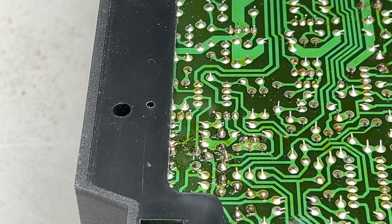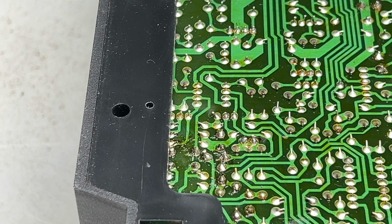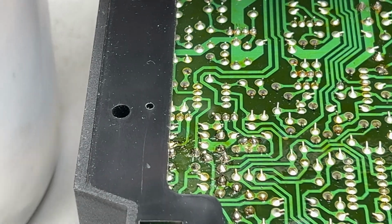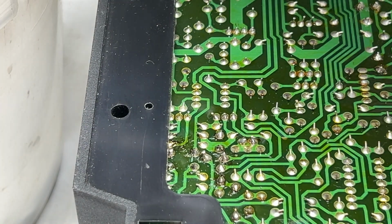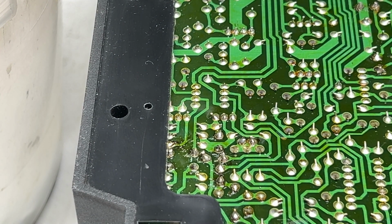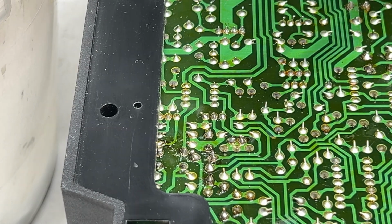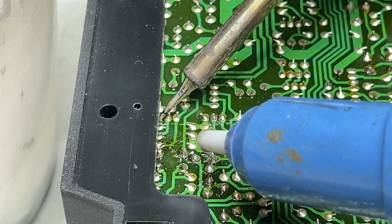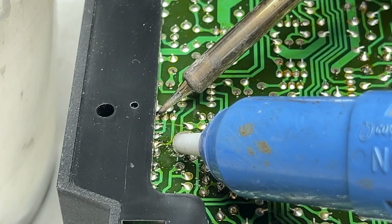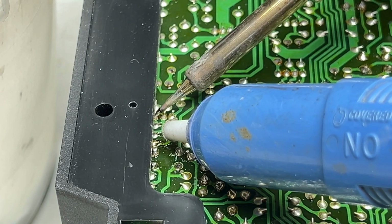Okay, so we are about to desolder those two transistors and swap them around. I'll just get my solder sucker ready to go here, and hopefully we can do this. The iron really needs a new tip on it again, but I'm not going to do it right now. Kind of hard to work around Denon's plastic, fantastic tomfoolery over here, but it is what it is.